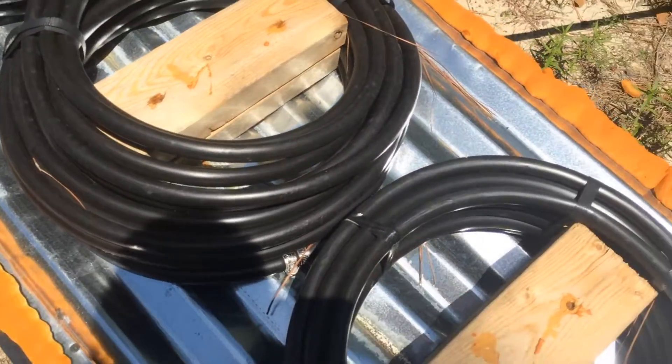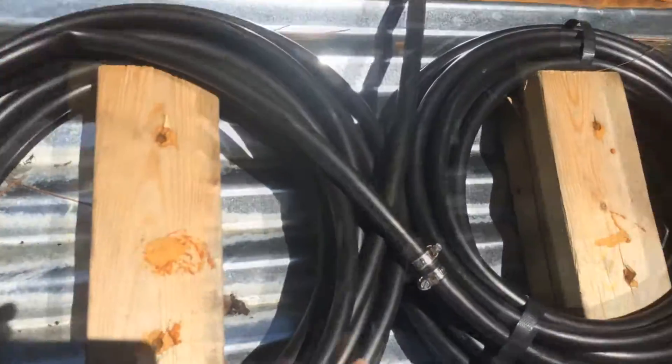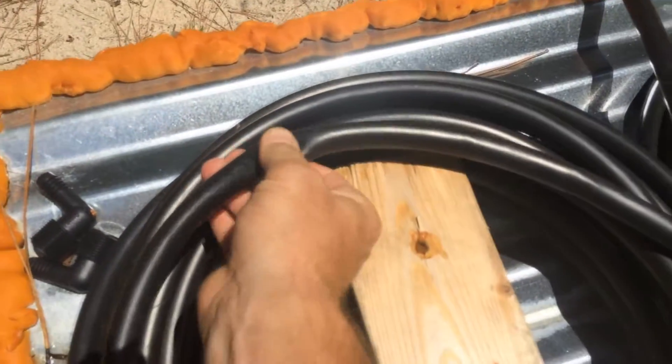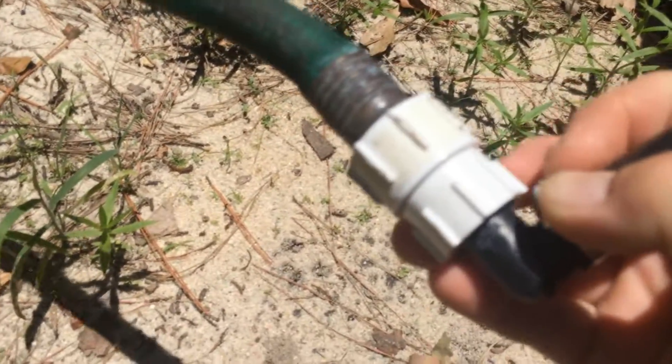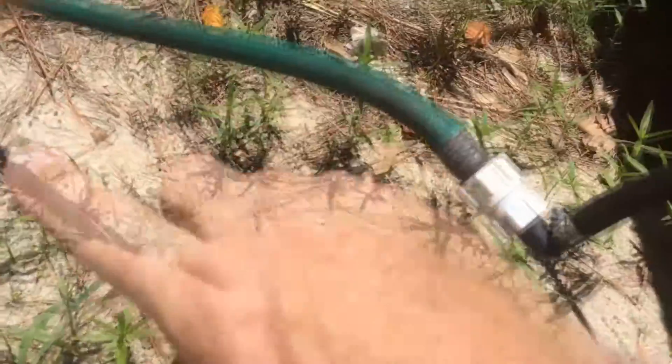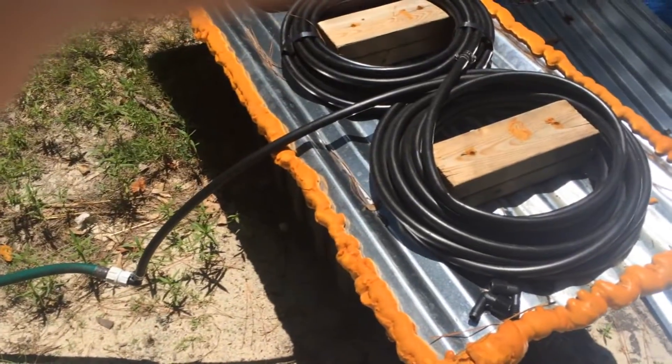It comes through 200 feet total. The two-by-fours are just to kind of keep the coil in a circle. You just want to make sure nothing is kinked — there's a little kink right here but it's not a big deal. It just cycles through all these sections and comes back out to the same fitting on the opposite side — half inch going back up to three-fourths, and then up to the pool. What you get with this is a slight increase in pool temperature when you run the filter — it goes through the filtering system and raises the temperature.